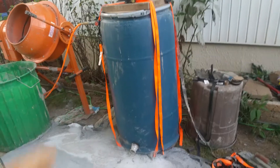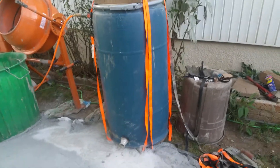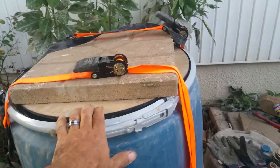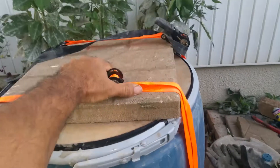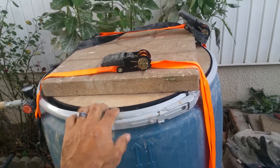There were some hazards to this which I expected, but yesterday while successfully pumping aircrete into the dome, the pressure became too much for the lid — which is something I expected, which is why I was putting bricks and ratchet straps to hold the pressure down, because the lid was my weakest point. It would let air out, and once the air began escaping the pressure needed wasn't enough to continue pumping.